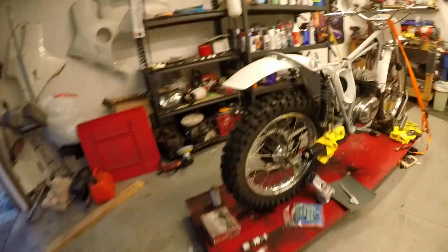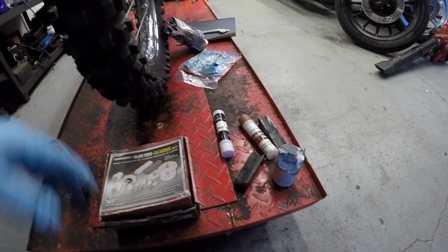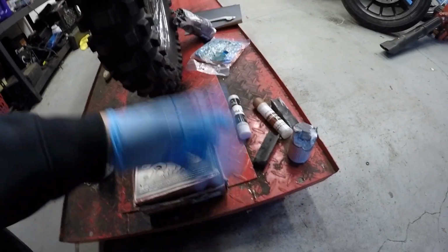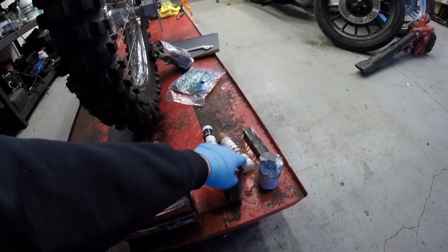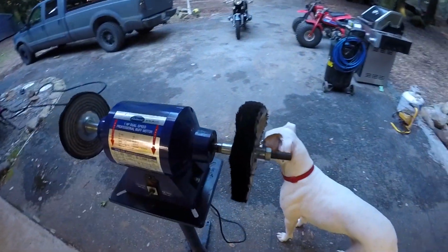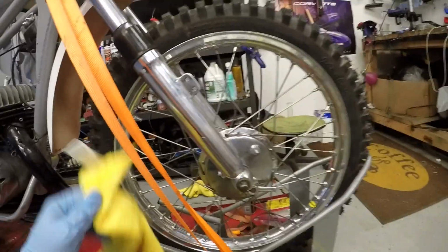So your first cut is going to be with black or brown, depending on what compound you're using. Now I've used all types of different compounds, and I'm going to tell you right now that the Harbor Freight stuff works the best. It really does. So the black will take out small scratches, then you go to brown, and you finish off with white. And on the white, you use the loose wheel, and if you've done your sanding, you can get nice, perfect finishes.